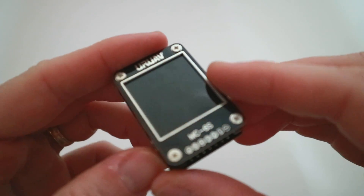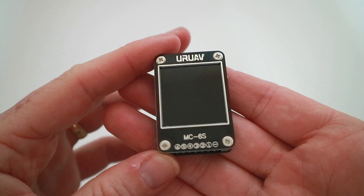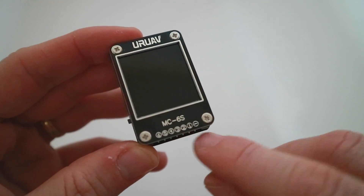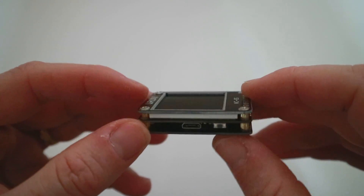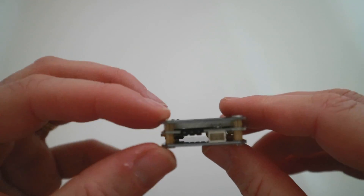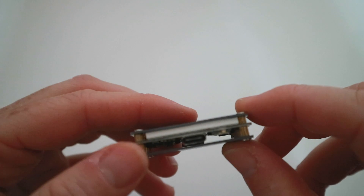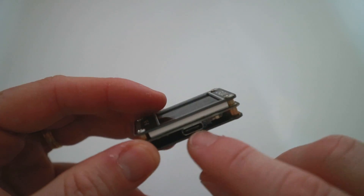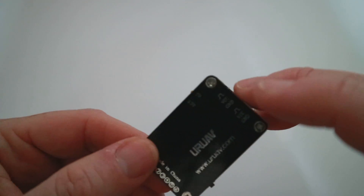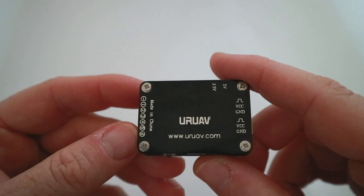Okay so this is the actual unit itself. You've got the pins to connect from ground and up to 6S battery — this goes in your balance lead and that will tell you how far your battery is. You've got the micro USB there. This is the menu key, we'll come to that in a second. Down here is where you can plug a receiver in, either a servo lead or one of those little micro JST things. And here is your USB type C, and this is a little switch to decide if you're going to output 5 volts or 3.3 volts to the receiver — that's if you're using DSMX or DSM where you need 3.3 volts, as labeled on the back there.